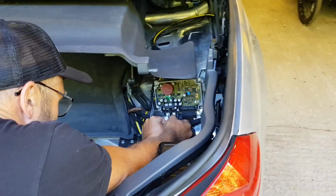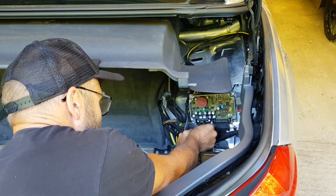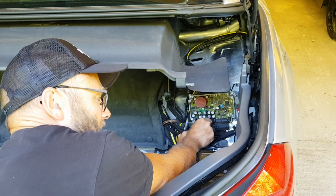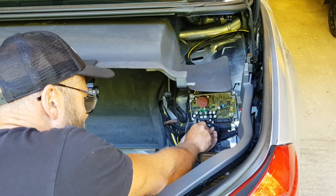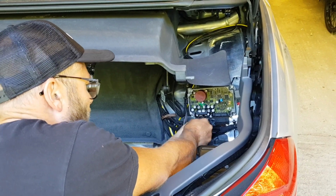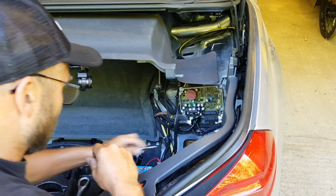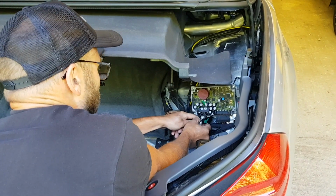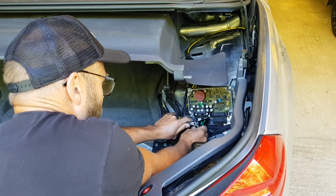So you didn't really realise that this was a problem until you decided to take the cover off one day and have a look? Or it was getting occasional problems? It happened a few times. A red warning light came up on the dashboard display. It was only up quite briefly, or you stop the car and start again, then you wouldn't see it again until the next time you drove it. But it got a bit more regular, and was like a battery warning light? Yeah, it was saying that the starter battery was not charging.